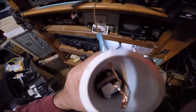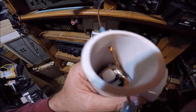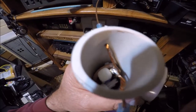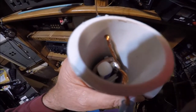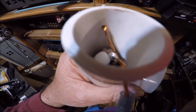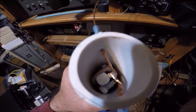I've taken the leads that go through the PVC and untwisted them — that was the only problem. When they put it together, the person sliding it through the PVC holes for the leads, you almost can't tell. You've got your fingers in there working the lead through, you pull it through, and you end up with a half twist where the two leads are connected together. That's what you don't want — it creates the short. The cap gets thrown on and glued, and that's it. But — success!